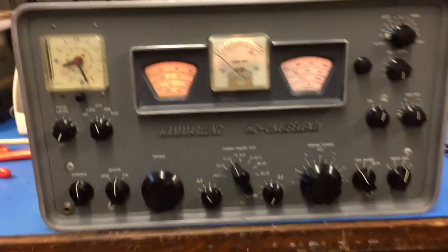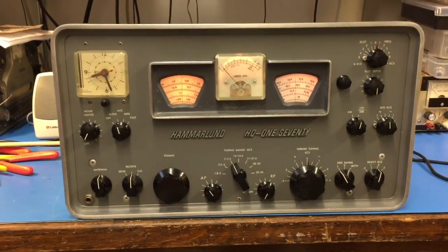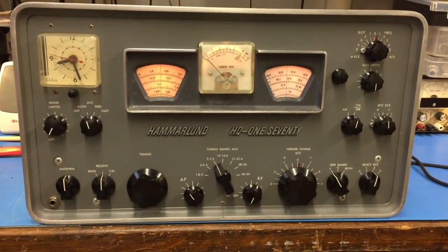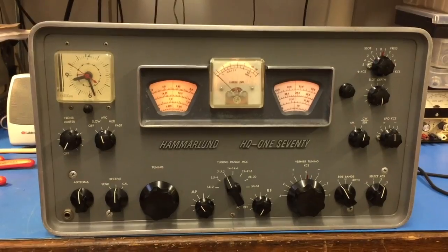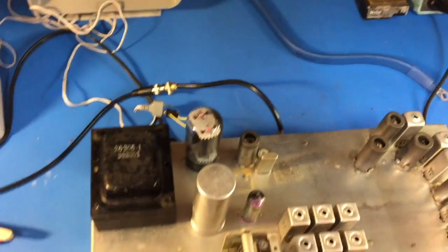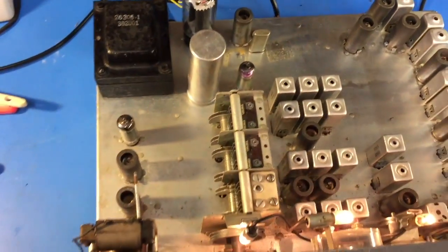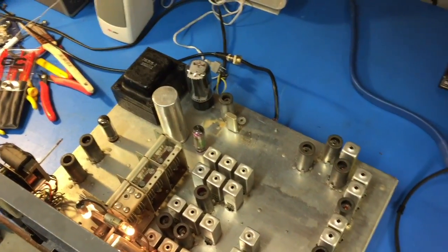This is an incredible radio here. It's made with ceramic disc capacitors all throughout. I did replace one electrolytic in the automatic gain control circuitry. The main power supply electrolytic — one of the sections has been bypassed, but the cap is not getting warm, so I will choose to leave it as is for now. The radio does have a fuse on it.